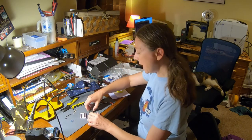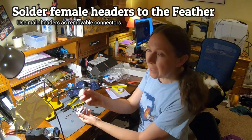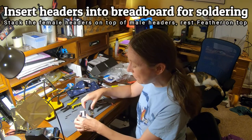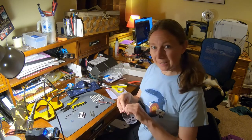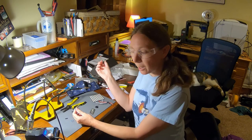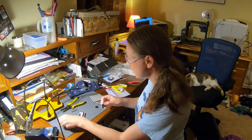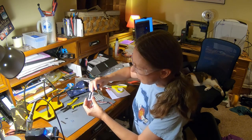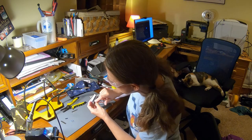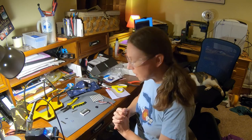The feather comes with short male headers, but I'm instead going to solder on female headers. The female header looks like this, and I'll solder those on by putting them into a breadboard and then setting the feather upside down on it so everything stays in place. Don't forget to wear your safety glasses. My thought is I'll use the male headers to make my wiring harness — these are the connectors, and I can pull them apart if I need to use the feather for another project later. Nothing will actually be soldered onto the feather except for the headers. I'll pause here to solder everything on, then pull the headers off and start the rest of the wiring harness.